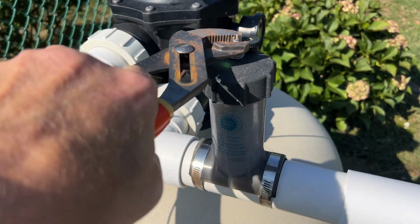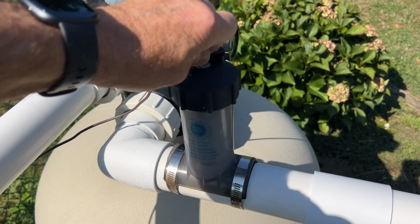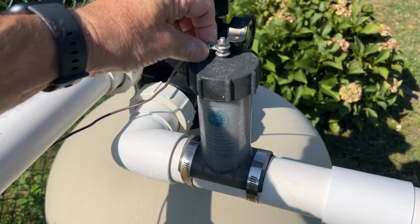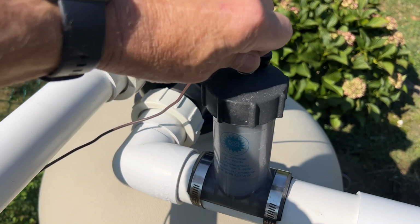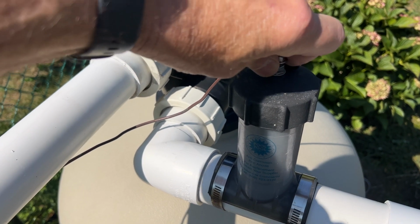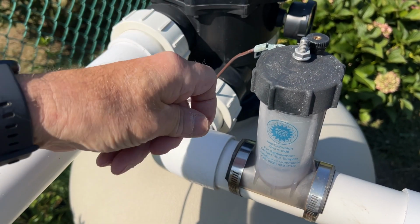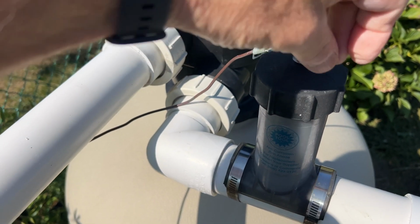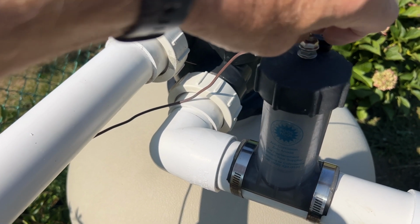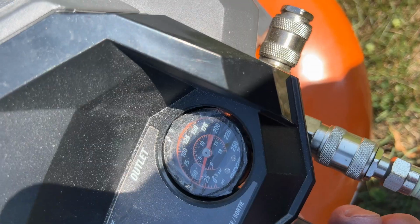We're going to take our adjustable pliers and loosen the wire up on top right there. This wire is held on with just a nut, so we're just going to loosen it up so we can take it off, and we'll bring this part into the house so that it's not outside in the winter and the possibility of freezing and cracking. All right, lift our wire off, put that nut back on the end of it, because you want to make sure where that nut is in the spring when you're ready to put it back together. So we screw it back on, push this off to the side, and that's it.